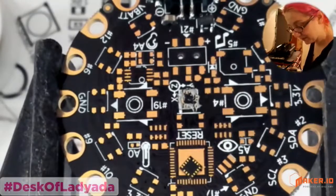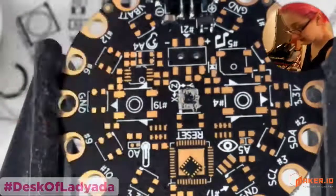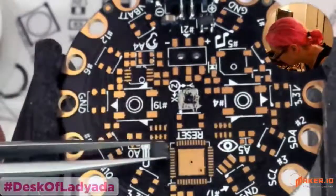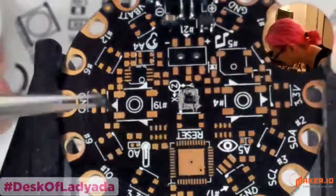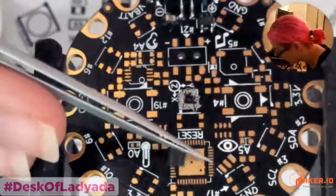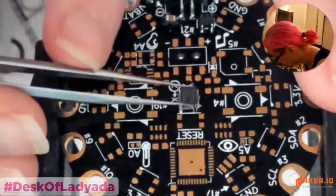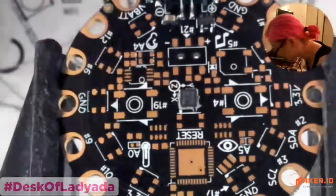But some surface mount parts have pads that go all the way around, so you can solder them by drag soldering, but for this one, you can't. So we'll grab this part, and we just have to make sure, even though there are pads only in certain locations and the paste is all over the place, it's fine, because when we solder it, the solder mask, the black mask between each pad, will keep it from shorting too badly. And then we look up on our diagram to make sure we have pin one set up correctly. And I'm trying to place it as close as possible.